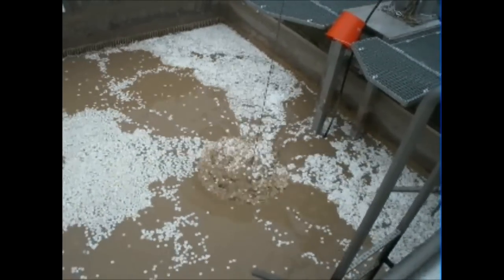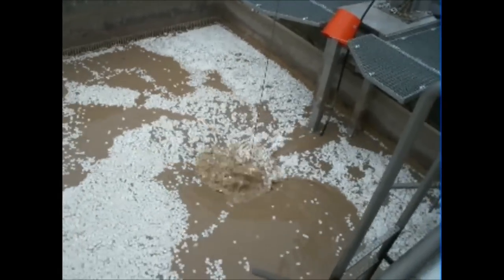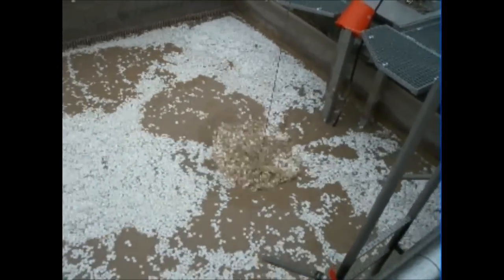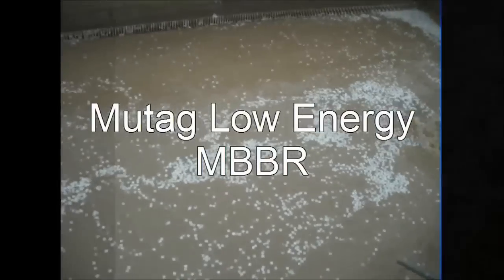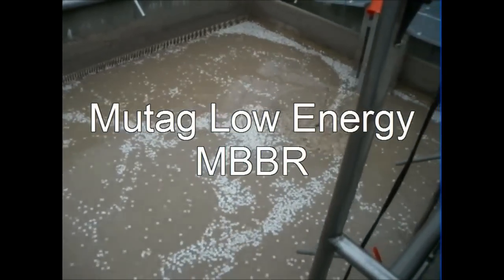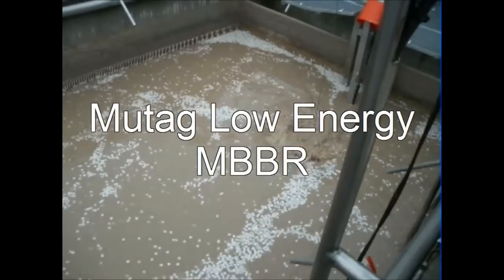This application is a useful and very energy-saving solution not only for mixing new carrier media into the tank, but also for anaerobic application and in the cases where the process air flow required for oxygenation is much lower than the energy required for properly mixing the carrier media.